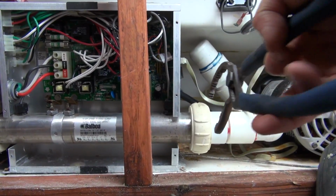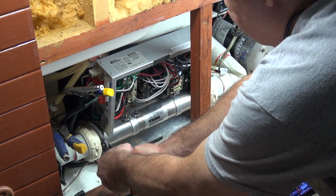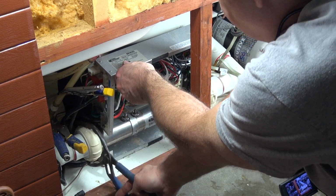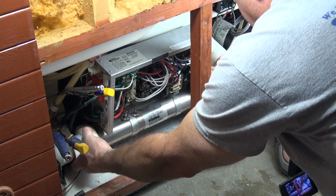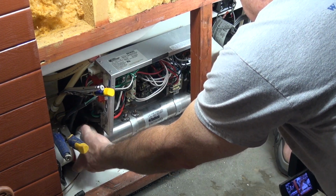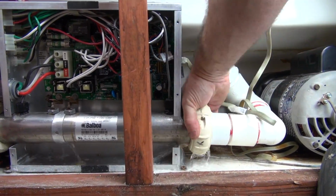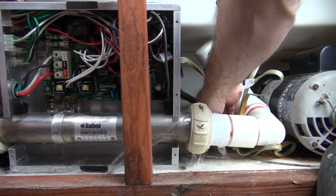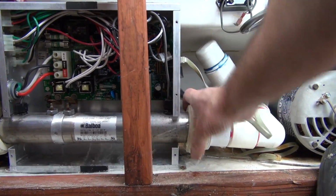And I'm going to go ahead and relieve the pressure here real quick. See if we're going to get much water. We should get some, but if you ever loosen a nut like this and you hear the water just gushing, then of course look for an air bleeder like we looked at. If you can't find an air bleeder, then your slice valves are probably just not going to hold. That happens when tubs get some age on them. Let's see, we're still getting a lot of water. So my slices are not going to hold very well here, I don't think.